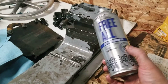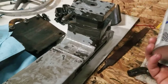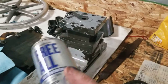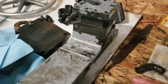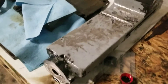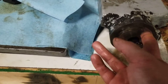It does have penetrating oil on it now. It is a water-based cleaner, so when you take it out of the water, hose it off — you want to get all that stuff off there. I blew it off with a blow gun and then hosed it down with penetrating oil. In my case I'm using Free All, which is good stuff. Most penetrating oil if you ask me is snake oil, but this stuff does seem to work pretty good. You can still see the dirt and grime on here that we didn't even clean off — it just got soaked. This piece here was stuck fast in there, and I didn't realize until I pulled it out and it fell on the floor that it's actually a separate piece — the water got in there and ate the rust out.